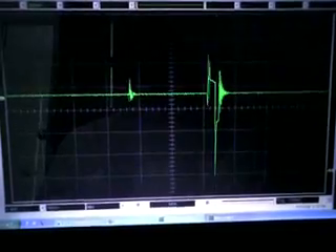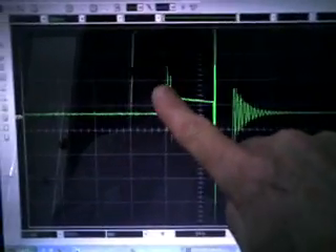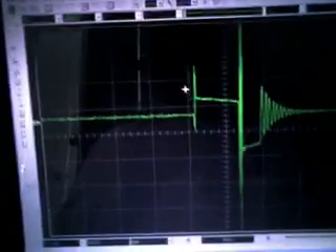It's very simple and basic — nothing complicated about it. Now I'll show you the scope shot. At 20 microseconds I'll expand that, and now we're looking at one pulse. I'll expand even more. This section here — from this point — is the on period, which I figure is somewhere around two percent: very minimal. All I wanted to do is create a back EMF, which you can see here as the collapsing field trailing off. Now I'll press the switch to trigger the diode to reroute that back EMF into the coil.